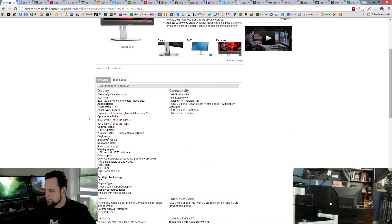I've been playing Wolfenstein: New Order on it at 4K, and I played some Half-Life 2 at 1080p — whatever resolution that is. I really can't tell there's any input latency. If we're going to do a lot of testing on monitors, I really need to build some kind of apparatus. If anybody has an idea of something I can build out of Arduinos — I've got tons of optical sensors, CMOS sensors, a bunch of Arduinos, an oscilloscope, and a logic analyzer good up to about 10 MHz; the oscilloscopes go up to about 100 MHz. I need to build something to scientifically measure end-to-end latency from the time I flip a pixel to the time it's done, accounting for USB or PCI bus latency. But the sniff test on this monitor — it passes. I was able to play a game and I couldn't tell that my accuracy was sufficiently diminished. Whereas when it was in 30 Hz mode, it was painful to play a game.